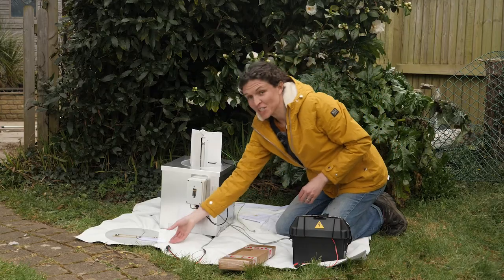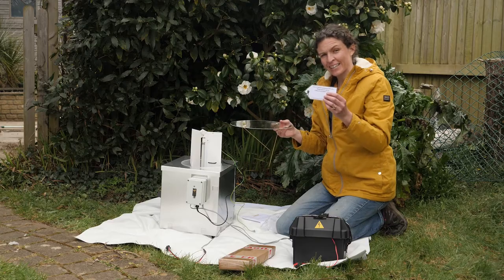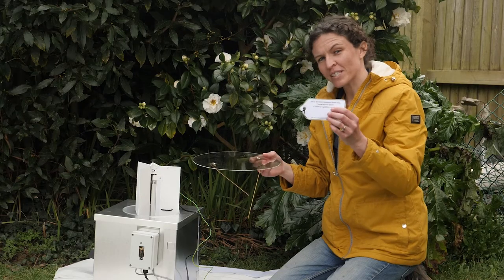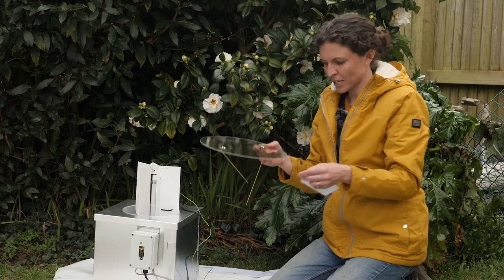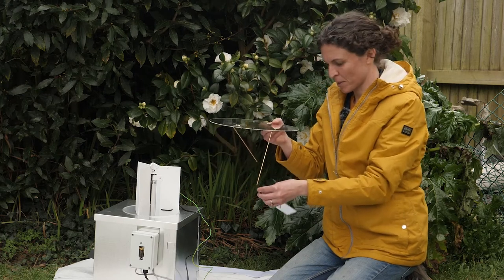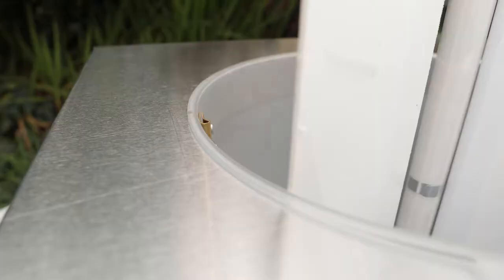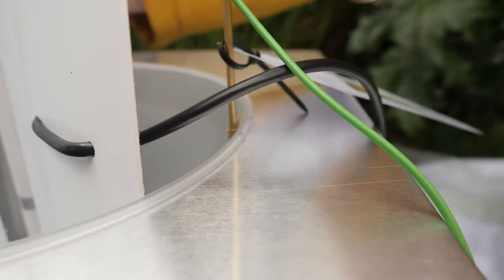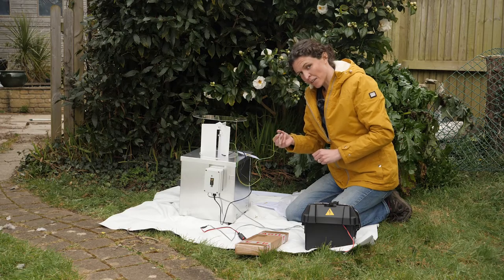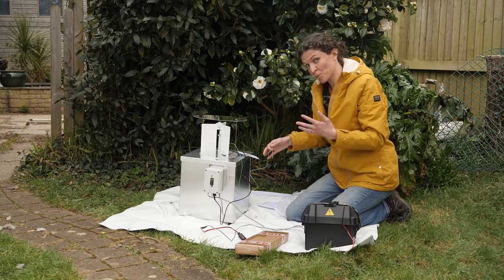There's also a rain shield to keep out any rain overnight. We've made a little tag, and we'd ask the person who's responsible on site for the moth trap to write their name and contact number on there, just in case there are any queries or problems with it. And that just slides onto one of the arms, and then the arms fit into the brass fittings on the funnel. This green cable here is an earthing wire, and that's just in case there are any problems with the electronics. It means you won't get a shock.